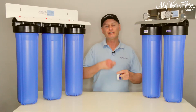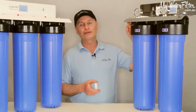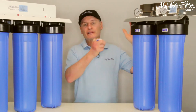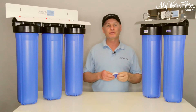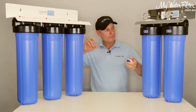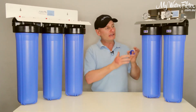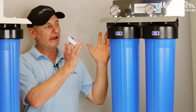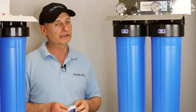It was just last week we had a customer — the plumber put 13 wraps of thread tape around the water pipe and then screwed it into the filter. He screwed it in so far, eventually he cracked the top of the water filter housing. Unheard of — never ever happens unless people use sealant or something goes wrong. But he put so much thread tape on and screwed it in until it wouldn't go any further with a big crescent. Then that night, when the temperature calmed down and got cold overnight, bingo — the head gave way and it cracked and started splitting and leaking water out.